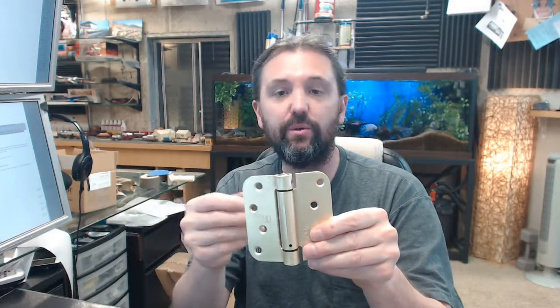The analogy I like to use is a tugboat. They don't go very fast, but they can pull a lot of weight. And having lots of spring power is like that tugboat. As the door comes through its closing cycle, you'll still have an ample amount of reserve stored energy in the springs, so you don't have to have the door move excessively fast just to limp all the way through the closing cycle. You can get it more controlled and then positively latching. That's part of it.